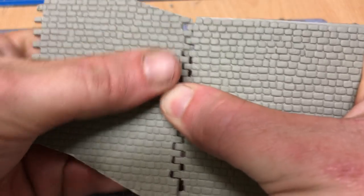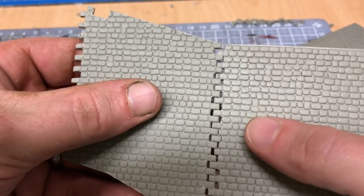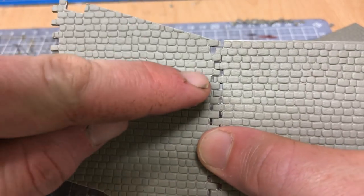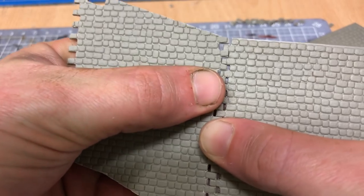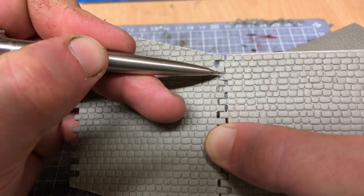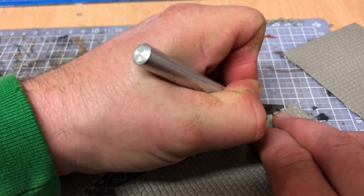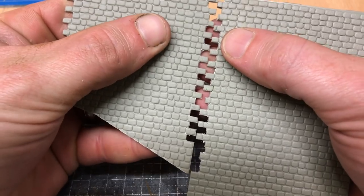Eventually both will join together. These are still a bit tight — I'm still working on them — but for demonstration purposes I'll carry on. Whenever you do join them together, you will still find there are large gaps in between. You could leave this, but I think there are too many large gaps and it's still going to draw your eye. So where a cobblestone is butting up against one on the other side and preventing others from closing in, mark that cobblestone and shave a little bit off at a time.